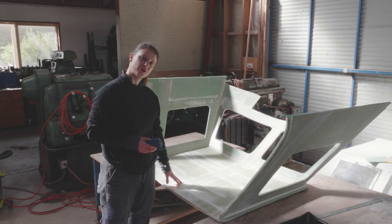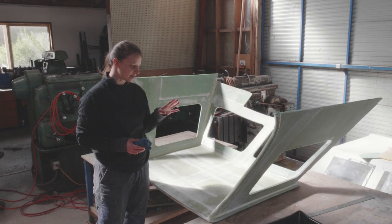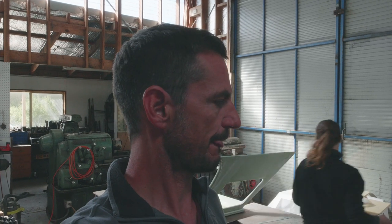Yesterday we rolled on some slightly thickened epoxy with a roller and it's cured really well. We are just wiping down now with some fresh water to remove any amine bloom. Amine is like a waxy substance that comes up out of the epoxy as it cures, and if you leave it on there it can prevent other epoxy — we're going to be putting two-part epoxy high build paint on — it can stop that from sticking. One way to get around it is to use peel ply, but we're trying to keep the amount of rubbish we're making down. The amines come off with water so we don't really think it's that big a deal. Everyone just makes their own choice.